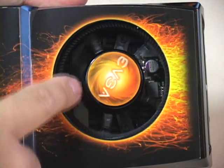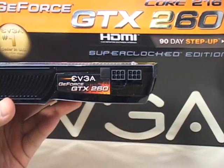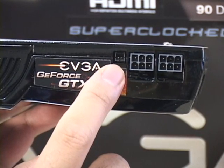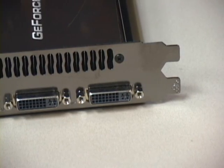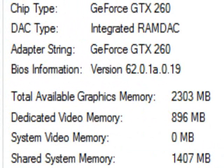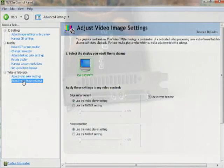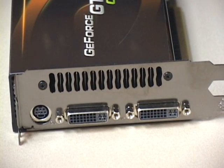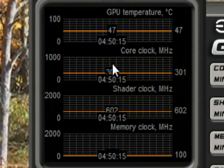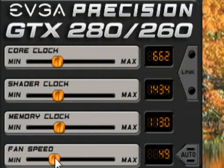The front of the card has a large squirrel cage fan that is quiet at low speeds and can move a considerable amount of air through the card when turned up. The top of the card has two auxiliary power connectors next to an audio plug that you can use to link the GTX 260 to your sound system in order to give you audio warnings in case there are any problems with the card. The back has two DVI-I ports below a 7-pin HDTV connector. With its 896 MB of memory, the GTX 260 can support up to two 2560x1600 displays and fully supports rotating and all other standard desktop functions. Everything is stacked underneath a large flow vent for cooling. EVGA bundles the GTX 260 with EVGA Precision, a powerful application that allows you to monitor the vitals of your GTX 260 in real time and tweak performance parameters including the core, shader, and memory clock, as well as the fan speed of the on-card cooler.